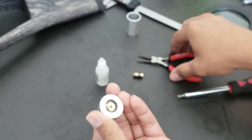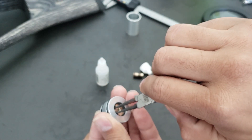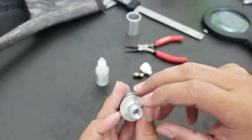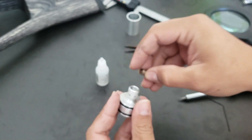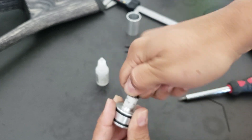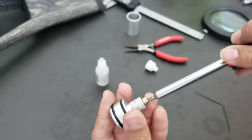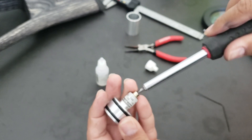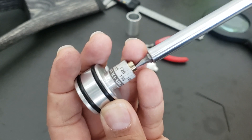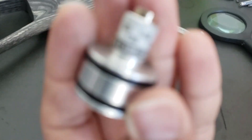Put the locking piece back and tighten the screw, making sure it is very well secured. Check that the plastic part is flat. Now put the brass adjustment screw back in. We're targeting 130 bar — I can see my mark line is now on 130.